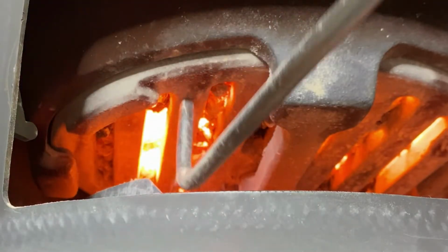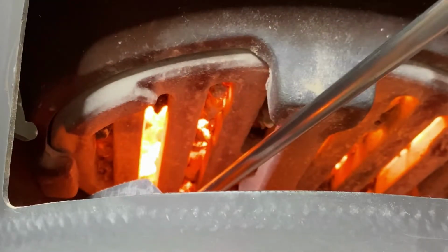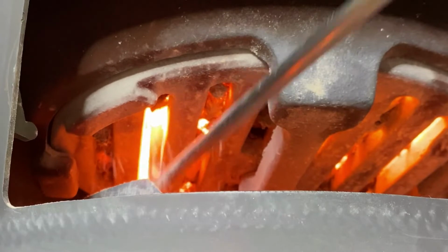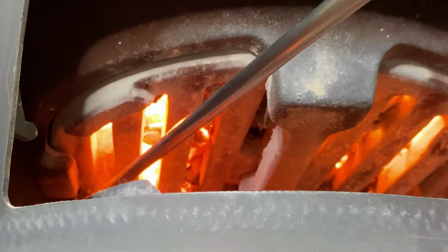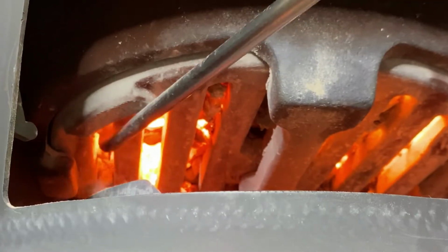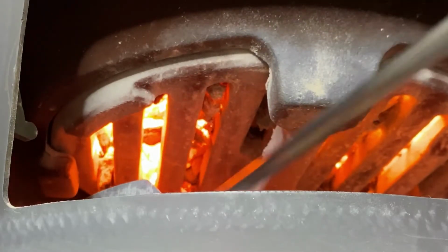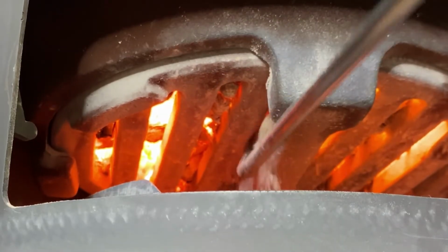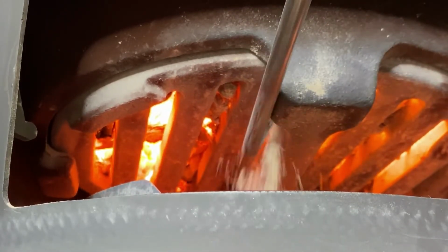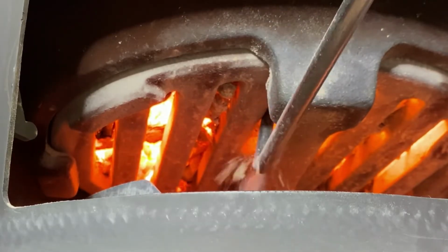And that's encouraging combustion. And well, here, this is a perfect example of just how hot and clean anthracite burns. In this case, without any fan blowing air on it or anything. This is just a natural draft, and we're getting this kind of heat. So all the slots need to be flossed, and then it's on to the shaking process.